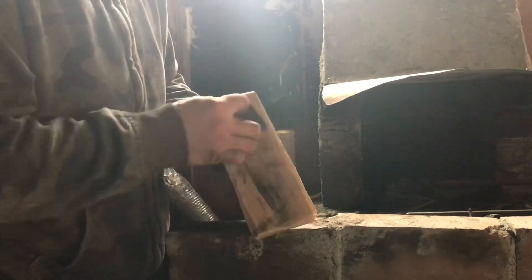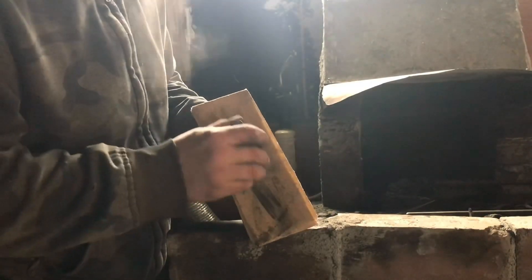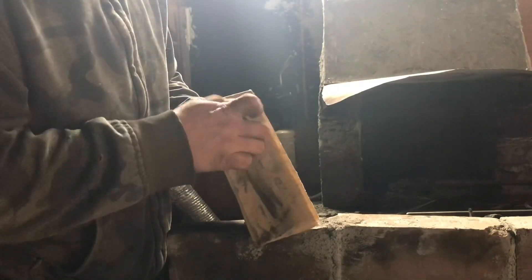Now to make the best use of these, you harden it and you don't temper it, or you temper it very lightly. The reason why you can get away with not tempering it is because it's got that soft iron back to it.